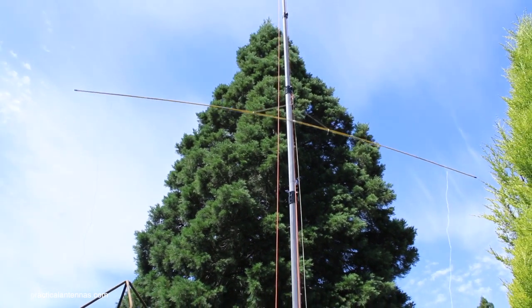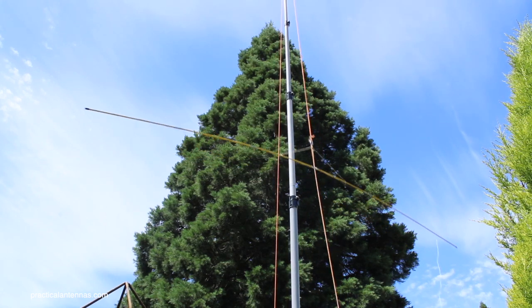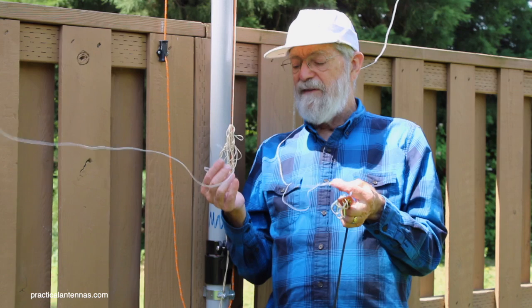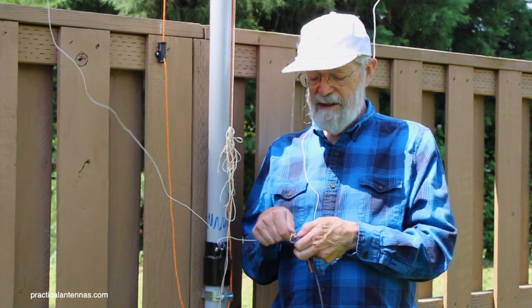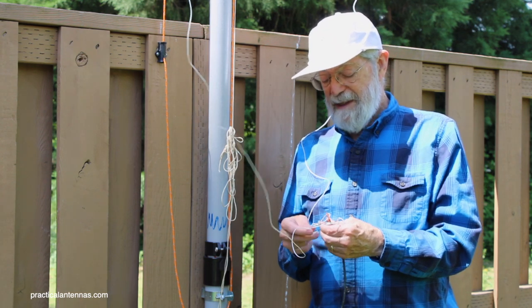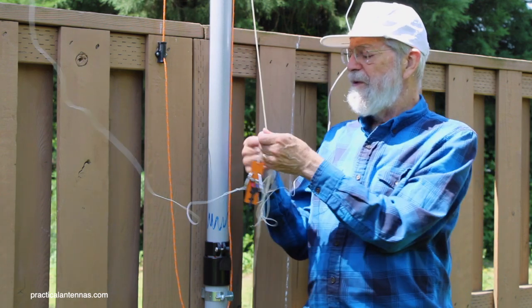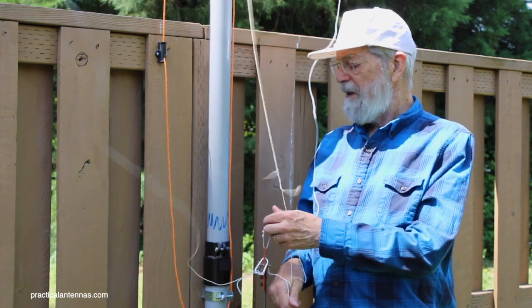Okay. So I'm stepping something up here. Okay, there you go. So I can raise this up until I can reach the ends of the wires. So at the feed point, I have the two ends of the loop wire, and I'm just going to connect them to my center insulator. Now this loop is dimensioned so that it gives a good 50 ohm feed point impedance. That makes it narrower and taller, and also reduces the bandwidth. But oftentimes that's a suitable trade-off.